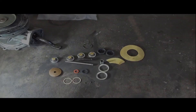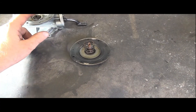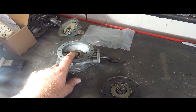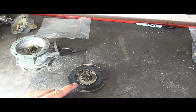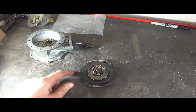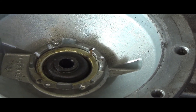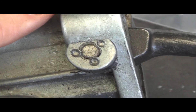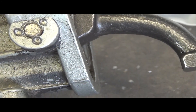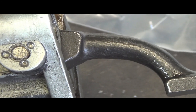While handling the assembly I was actually able to unhook the diaphragm from the feet directly inside the fuel body. For reassembly though, the manual strongly recommends putting this in straight without the arm, then coming in sideways to hook it correctly — to avoid damaging the oil seal. My situation is complicated by three dots on the housing where the arm and retaining clips have been riveted or dented in at the factory so they cannot come out easily.